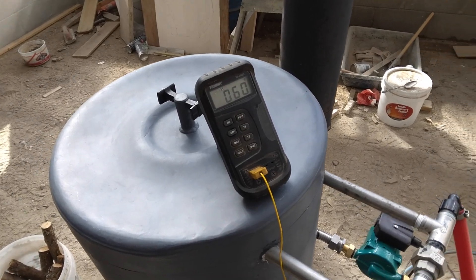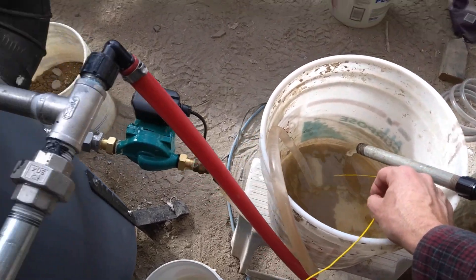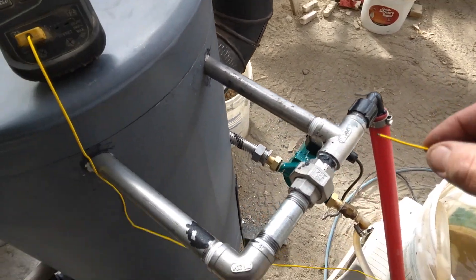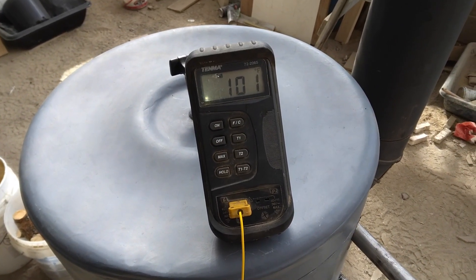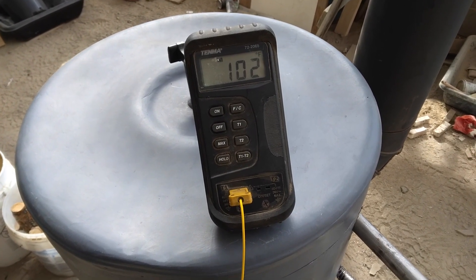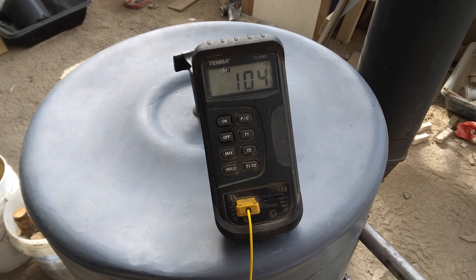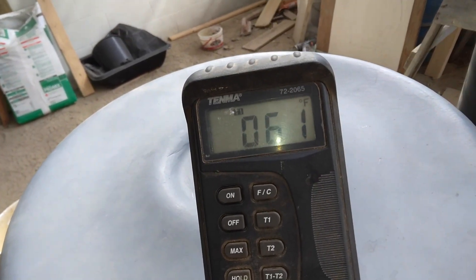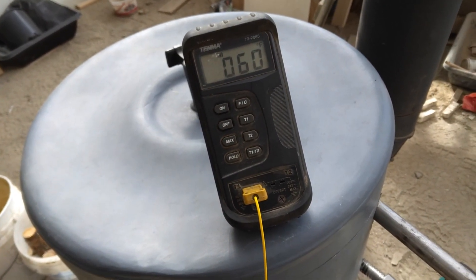The fire has been going just a couple of minutes. It's been circulating and starting to warm up — the loop temperature is now about 59 degrees. Touching the probe to the outgoing hot water, it's already over 100 degrees, 103 and still climbing. Now at 105 degrees, with the loop temperature at about 61 degrees — so we're getting a little over a 40-degree temperature difference.